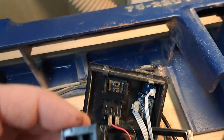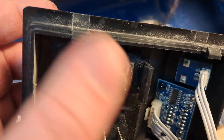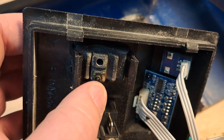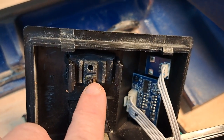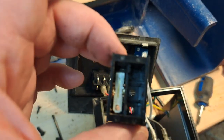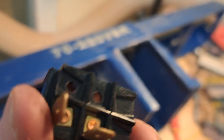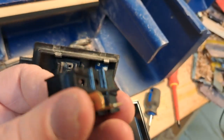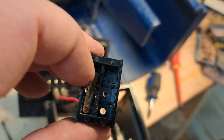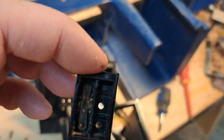The switch is actually a deceptively simple design. There's a little spring-loaded peg, and when the switch is down in the off position the peg sits up. When I flip the switch into the on position, it inverts the peg so the peg goes to the down position, and that peg seems to rub in here. There's a piece of metal on a seesaw-type mechanism, and it seems to push the seesaw into the contact. When the switch gets flipped up, the peg goes down and pushes the switch onto the contact; when you flip the switch down, the peg goes up and is supposed to push it off the contact — and for whatever reason, in my case it wasn't doing that.